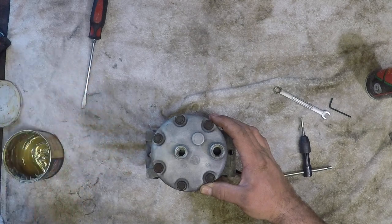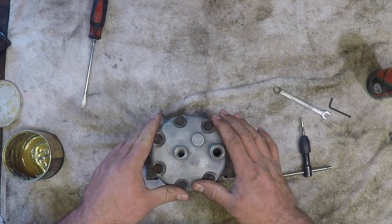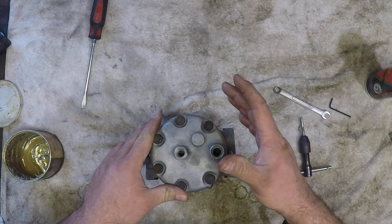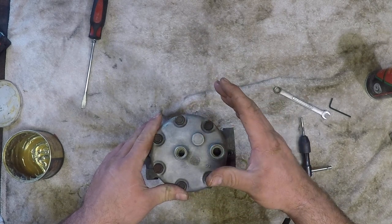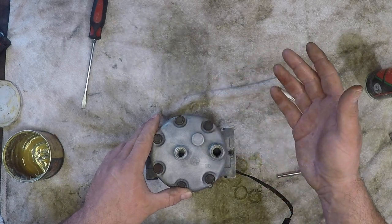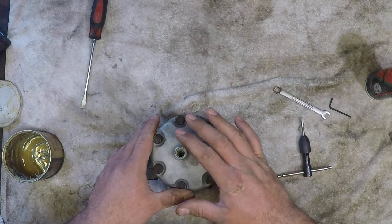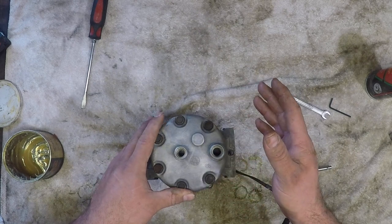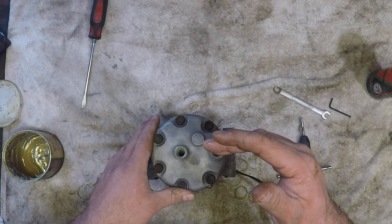If you're running this a lot, the air gets really hot coming out of here. If you use regular air brake line — which a lot of these installations use, available at a truck stop or truck supply — it can melt under high temperature. This compressor will make the air hot enough to melt that air line, which gives you a hole in your line and causes another issue. If you don't have something to fix it, your compressor is pretty much dead in the water. Running it through a factory AC condenser first would take the temperature down quite a bit and probably save your air lines.